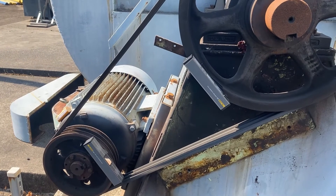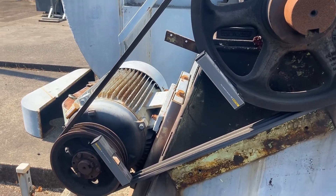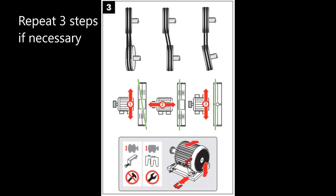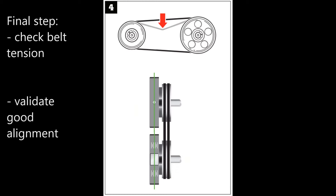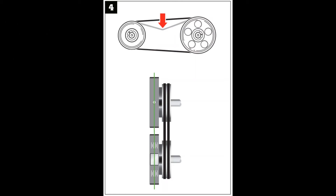Step 4 from the quick reference guide. By following these simple steps, alignment of the belt drive should be quickly completed. However, as any one alignment condition is liable to affect the other, repeat the three steps if necessary until the system is aligned. In the final step, validate good alignment. Laser lines harmonize with reference lines on both units. Also check proper belt tension.